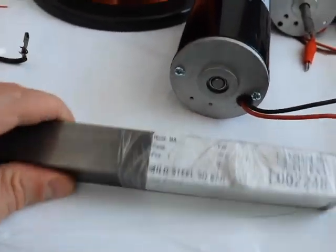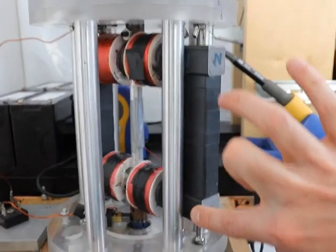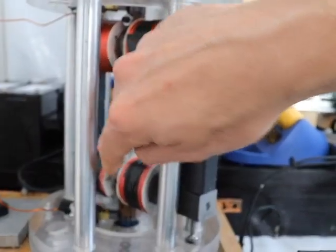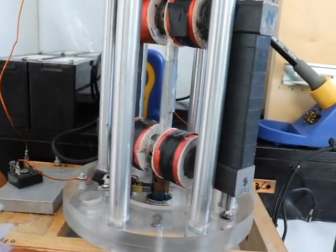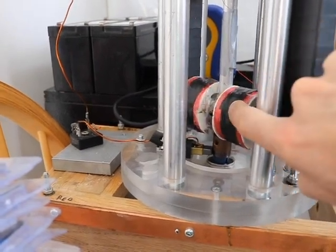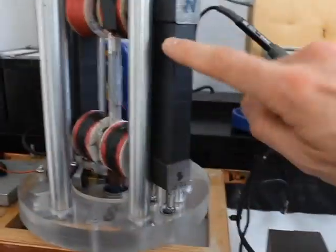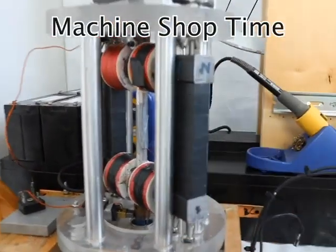What is the square stock for? The square stock is for these pieces on either end of the stacks of magnets, and also the center piece where the coils are wound around — that's all ferrous. And the mag wire is obviously for the coils that are wrapped around the steel cores for the magnet stacks. We're going to have four stacks of magnets, not just two, on the next machine.